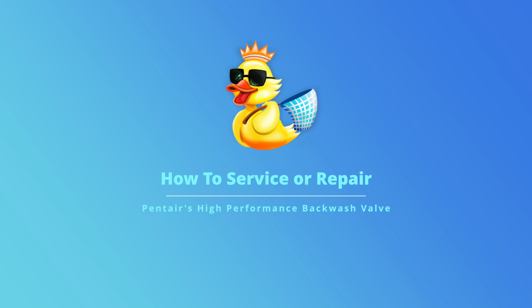All right, so now we got the lid of the valve off. And what I really like, Pentair did a really good job making this very simplistic. But you see here, this is in filter mode right now. Just going from the pump over here and going straight through into the filter. And then to put it in backwash mode, go ahead and move that over to backwash. And now you see this part's open down here with a recess. The water passes down through that. Take this part out. And now you see the backwash paddle is now not blocking the backwash port. And that's how you backwash this thing and clean the filter.